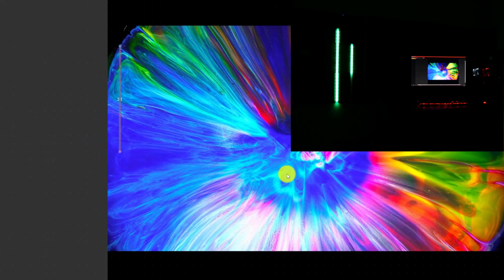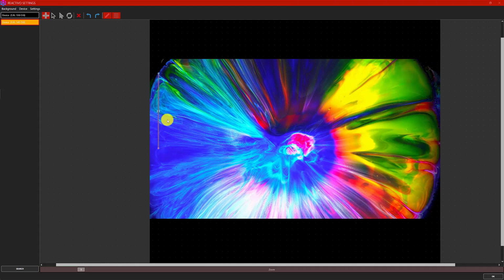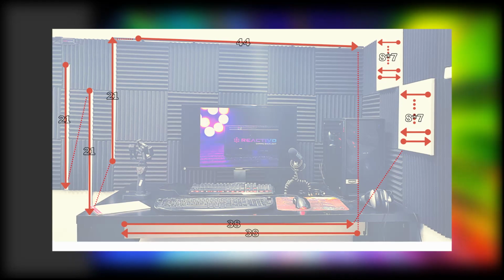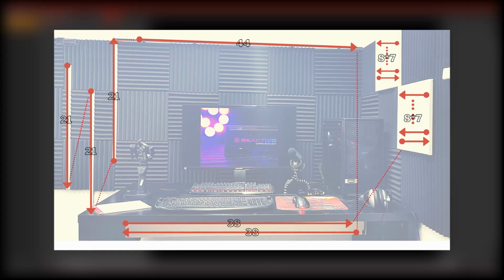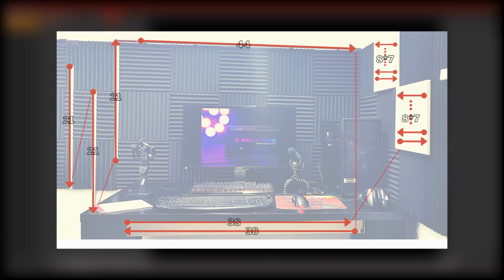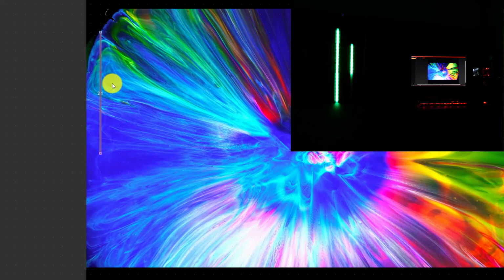There are two key parameters to follow: number of diodes in your strip and the signal flow. Check out this highly advanced scheme for this particular setup. We are starting at the top of the leftmost strip. Arrows show the direction of the signal and the numbers represent the diodes in each segment. Strongly recommend to create such a scheme for your own project. If you follow it, there is small room for error.